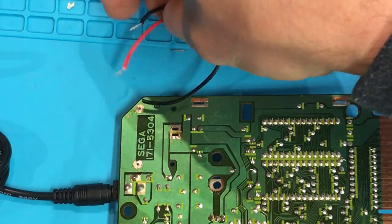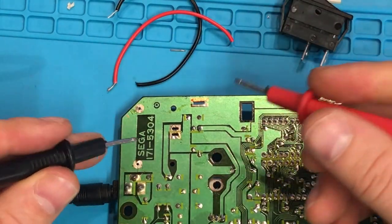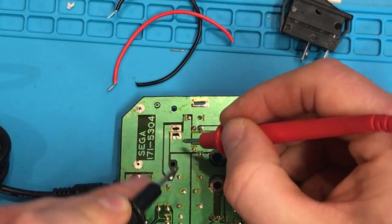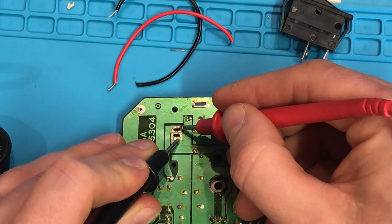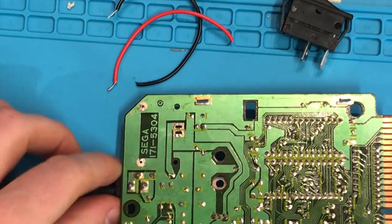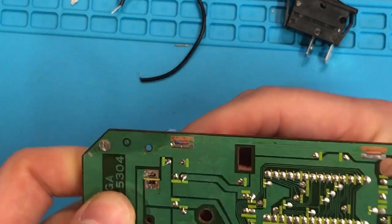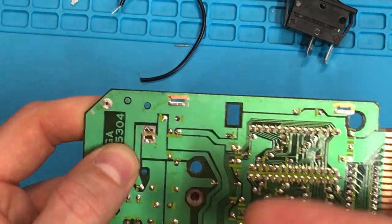I've prepared two little wire conductors — one's going to be nine volts, one's going to be ground. Just for the OCD folks, let me measure with the multimeter to work out which pin is which. That's the correct polarity — that one's ground, that one's nine volts, nine volt input before the regulator. So the red wire goes toward the outside. I'll unplug the power again. I've stripped a bit of wire and I'll just poke it through and fold it over the back and solder it straight on.